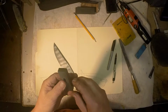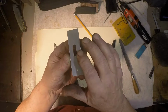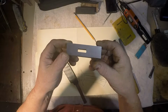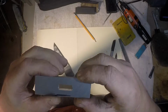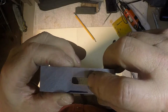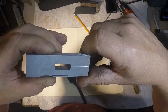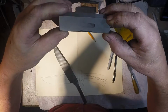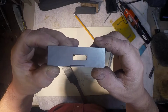But anyway, I just took a 1/1000th of an inch off of each side. And by the way, I only mill halfway through this on each side, and then I flip it over and mill it through the other half on the other side. So these indicator lines here that I use to line up on that mill vise go around the block. So you flip it end for end. When you mill anything, you never flip it like this. You always flip end for end, so you have your same side on your reference jaw, on your stationary jaw.